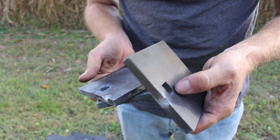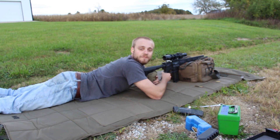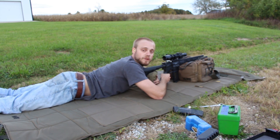We're going to put the steel back together in a random order and shoot another mag at it. We're running out of daylight, so we're going to do one more test with a full mag on the cut surfaces, and we'll do the conventional shooting on the edge later. The water jet performed about as we expected — it's cut without heat, so the edge is just as hard as the center of the target. We had tiny little divots from a 223 at 100 yards, which is normal, but we're going to verify those results again with 30 more rounds.